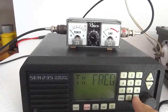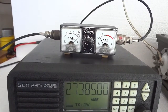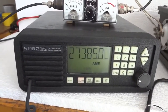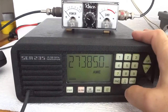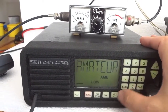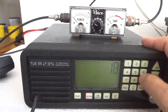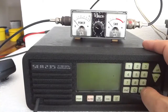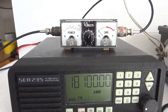Some of you might want to see CB, so why don't we try that too. We are at 27 megahertz - it does that too. With your 5 watt radio you should be able to tune this, because the carrier output on this radio at low power is about 5 watts. Let's try one of the MARS bands as well - and it does that too.